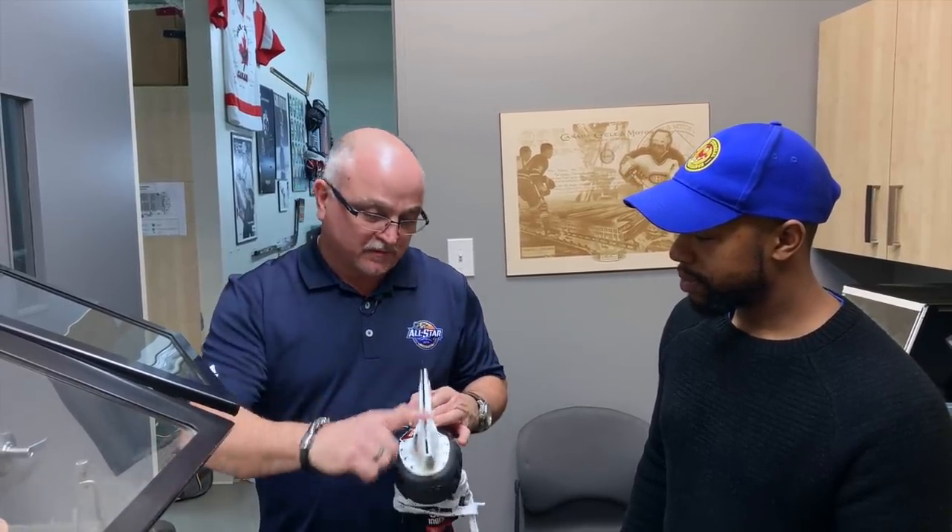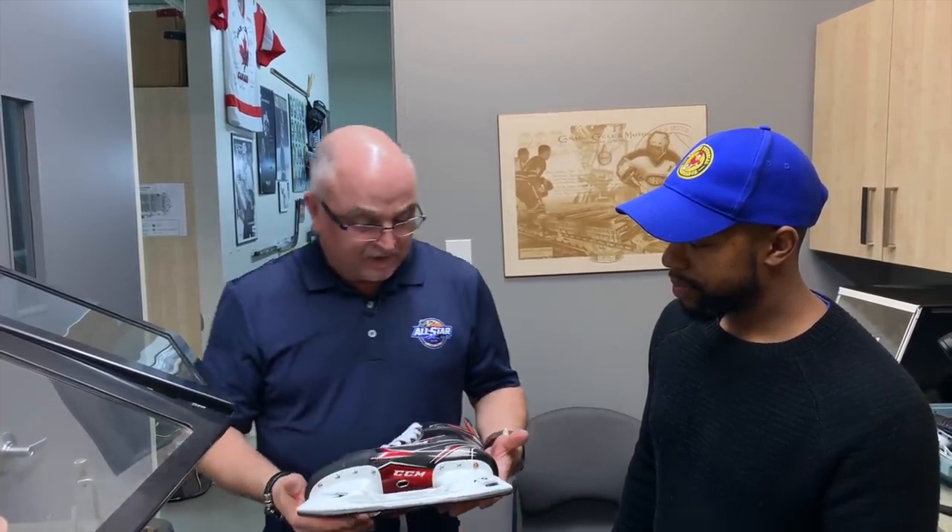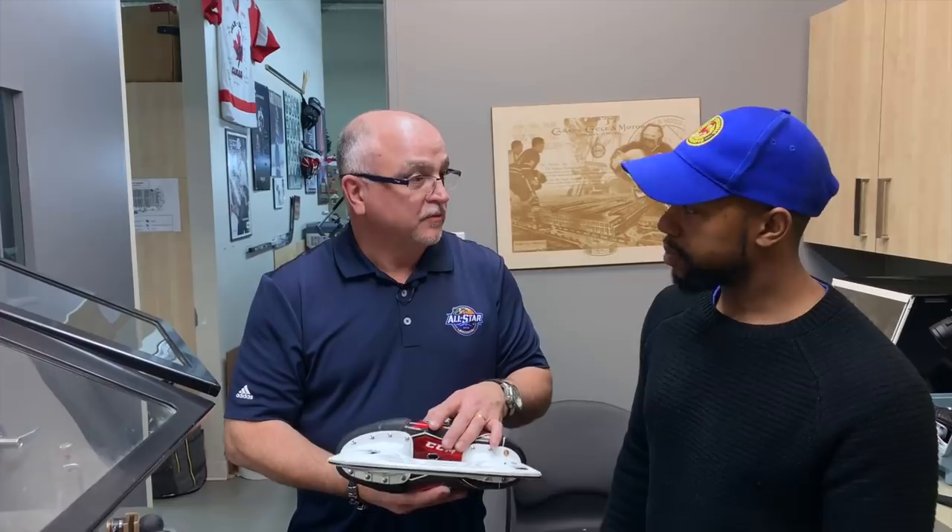You want a proper balance — you have to have a proper radius forward and also down the middle of the blade. You can sharpen your skates either toe forward or heel forward, but both skates must be sharpened the same way.